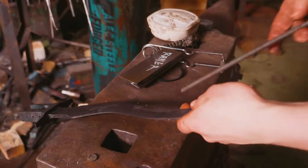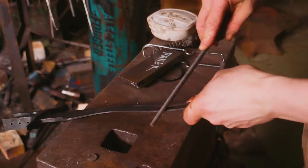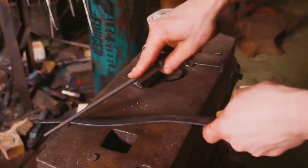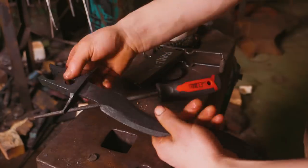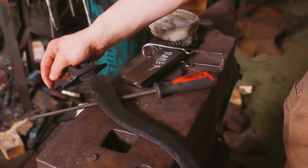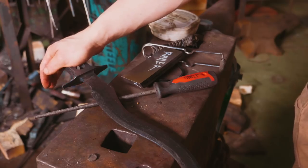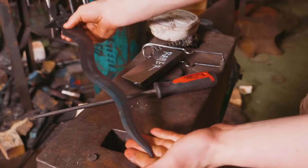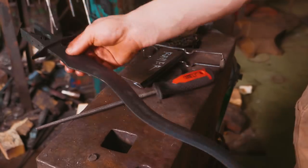Second attempt — hard here, perfect — but it digs in. It is too soft here, it hasn't hardened fully. I don't think I had an even enough heat — my bad. Back into the forge we go. We are going to give it a third attempt with the hardening after a little normalizing cycle. Hopefully we'll get this thing to an even hardness the whole way this time around.